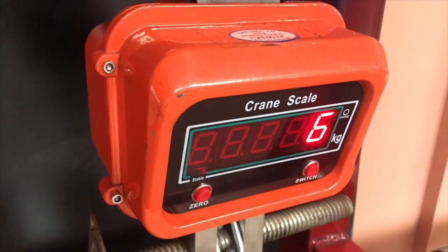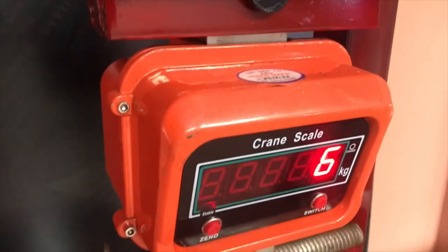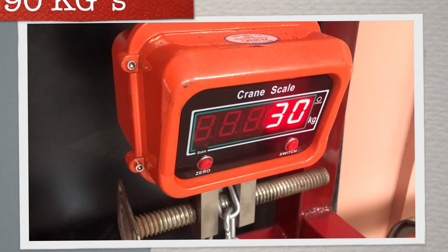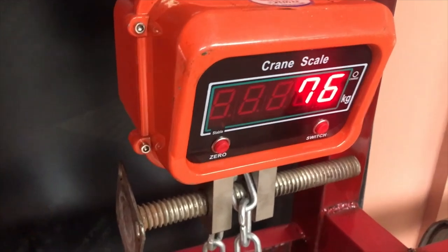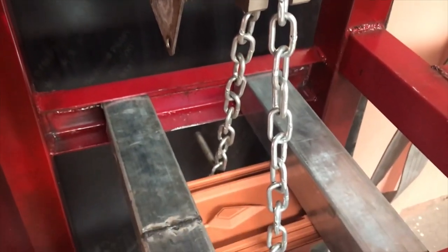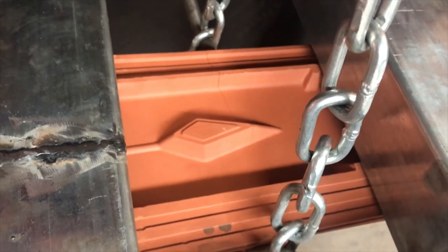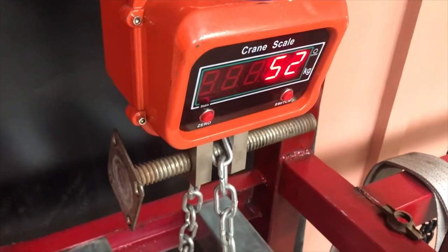Just going to start jacking him up now, taking the pressure. Just starting to pull up on it now. 20 kilos, 30 kilos, 60 kilos, 80 kilos. What's cracking there? It's cracking now. That was at 80 kilos. You can just see a hairline crack opening up. Now if you were walking on this roof, this would actually be stronger because it would be overlapped on each side by another tile. So 80 kilos is what we put on that before it cracked. Let's finish him off.